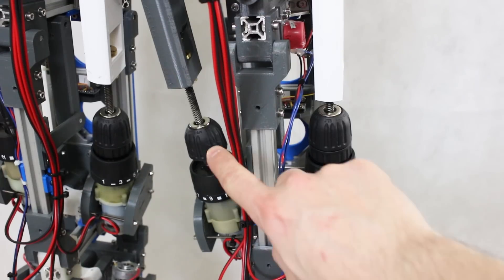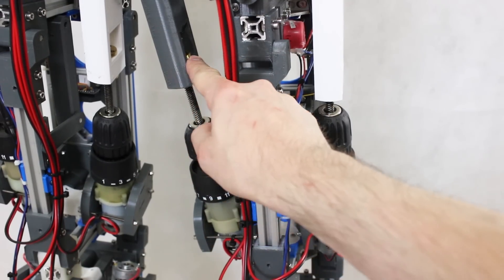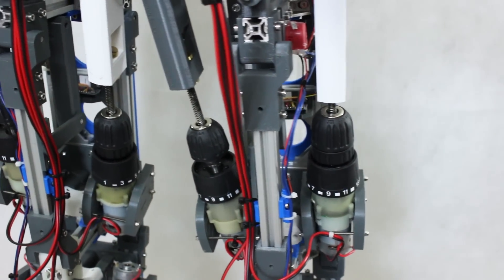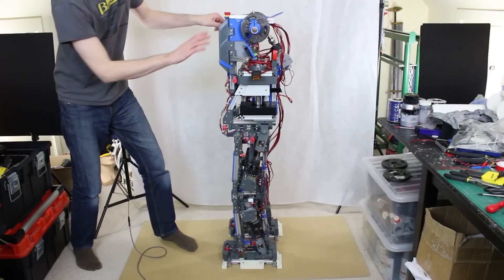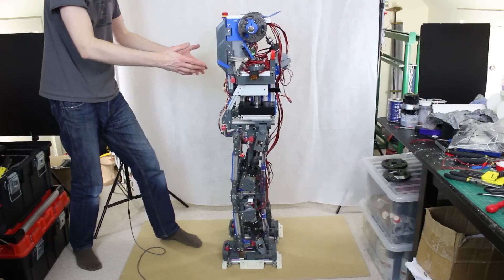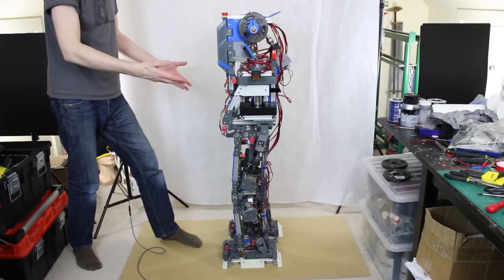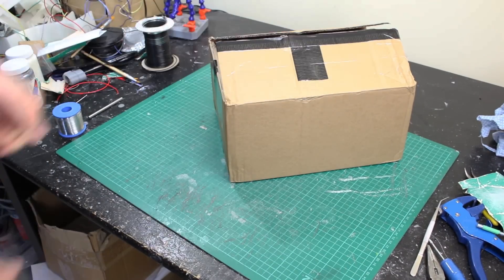Up to now I've been using actual cordless screwdriver motors with the chucks still on and lead screws in the chucks. There's a nut in there and that makes this go in and out. There are eight of them, but they're actually pretty sloppy and pretty wobbly, so lots of the code I've implemented has been to compensate for that, which is probably why it walks backwards. Some of the code helps it absorb the load when a leg is pushed in a specific direction, which makes it quite dynamic, but it also means if there's a slightly off-center mass on the robot, it ends up traveling in that direction. So we're going to get rid of the cordless screwdriver motors and put something much better in.